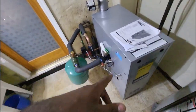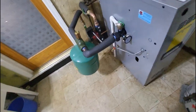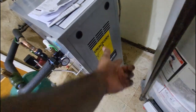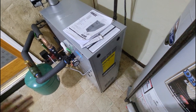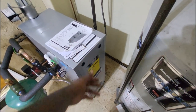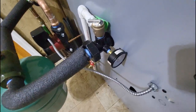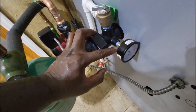We've actually been using Force boilers for about two years now. They're pretty easy to install and service. Inside you have your aquastat and your spark ignition board — nothing fancy, similar to most new boilers, which are going to have some type of aquastat and some type of spark controller, and of course your gas valve.